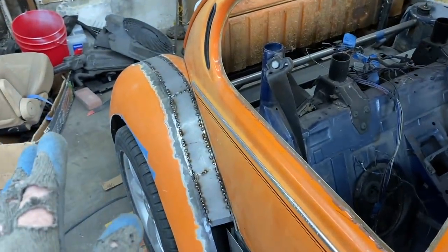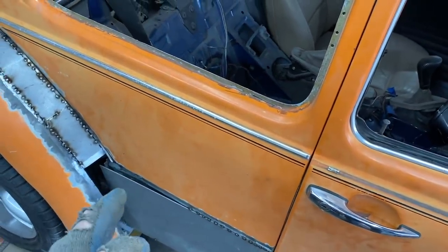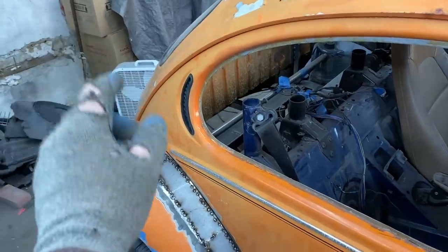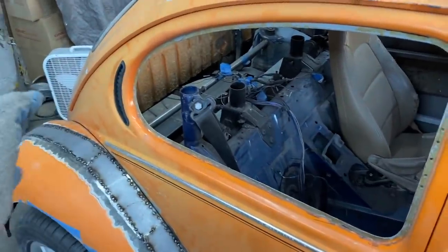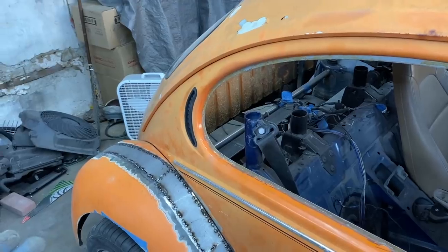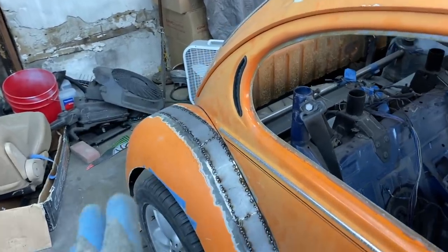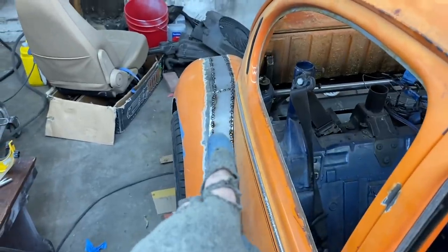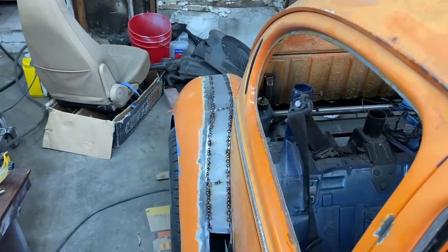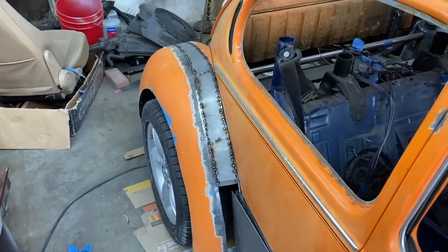And the back end of the car's off. Up until all the mounting, here is millimeter perfect. And then by the time you get to the rear frame horns that I've made, which are bang on, the slopey down C-pillars are over a 16th, maybe an 8th, something like that. But it's about that far over. So that kind of throws everything off. So these strips aren't the same size as the other strips to get 3/4 of an inch wheel poke, which I kind of like. Think it is good. Don't know what suspension travel is going to do.